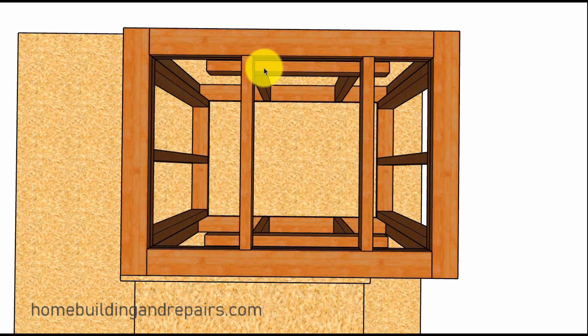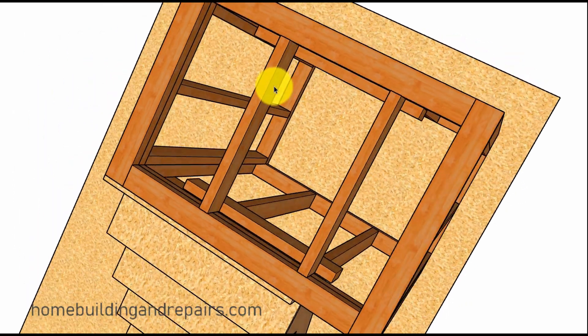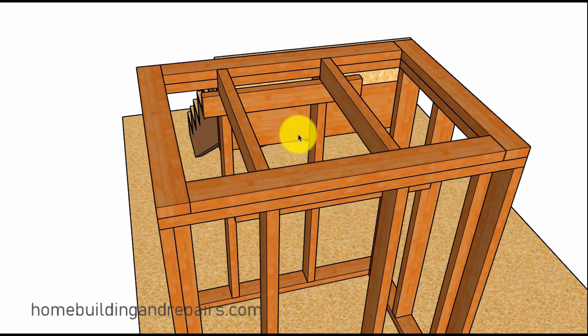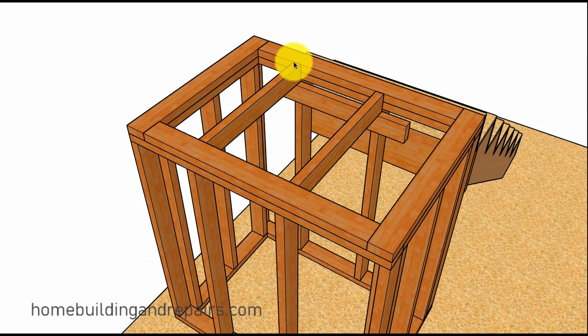Here's a method that will work but might not be approved by your local engineer — simply nail a scrap piece of lumber onto the framing studs. This could run full length and would be used as a ledger to support the joist. You could also toenail the joist into the framing plates for more strength. Nail like a two-by-eight or two-by-twelve underneath, put about four nails into the studs, set something on top, nail the plywood off, and the plywood will hold everything in place. You might want to use two-by-six or two-by-eight, whatever will work for the span of your particular landing.